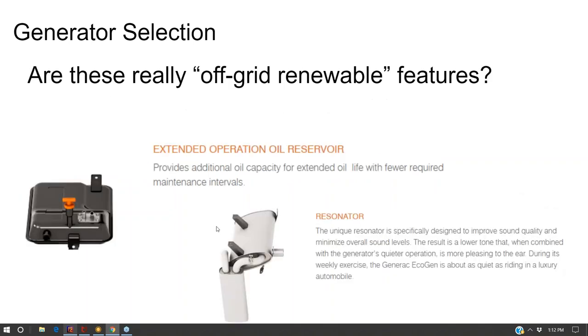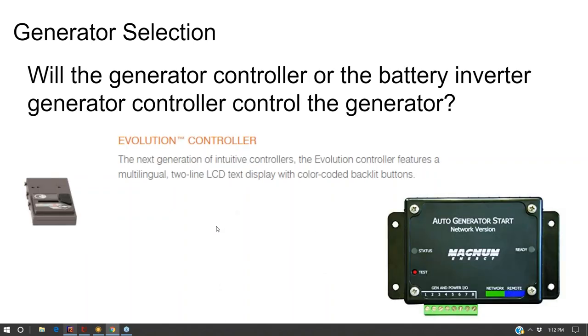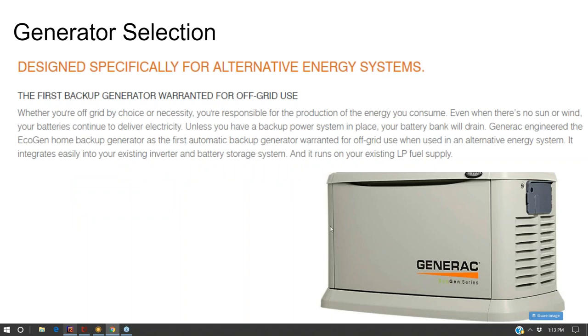So there's a number of different ways you can wire a battery inverter to a generator, and depending on if you're trying to complement the power together or use it as a charger for the battery bank or use an internal bypass switch inside the battery bank or keep it completely isolated with an external transfer switch, there's different design considerations related to sizing. And that's a problem when it comes to stationary generators, because stationary generators have become so large now that they're really better used to bypass the solar array entirely. And then you just wait for the sun to come back up to recharge your batteries rather than using the generator power for that.